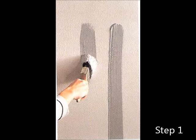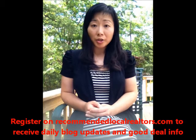Scrape off one side of the brush on the side of the can and paint 2 thick vertical stripes on the wall, approximately 2 feet long and 6 inches apart. This should transfer most of the paint on the brush onto the wall.